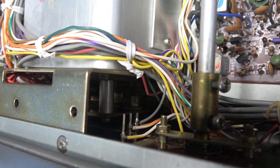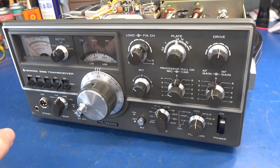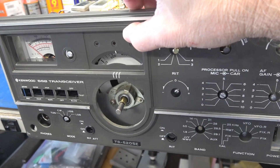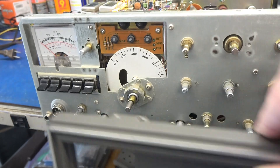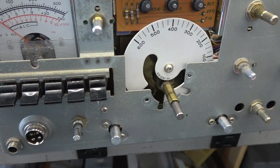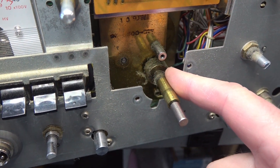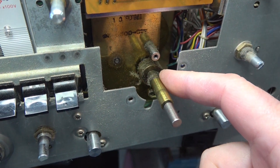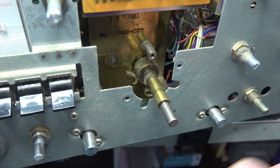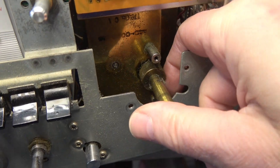Unfortunately the only way to get to that is to remove the front panel of the radio, so it is a bit of a process. All the knobs have to come off, there are some screws that hold the plate. Got all those knobs off — getting closer. You have to remove the bearing plate, and this dial is going to have to be removed. There is the knurled cover for the vernier drive — I believe I can simply spin that off and get to the inner workings.